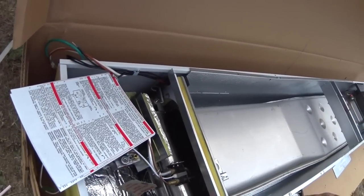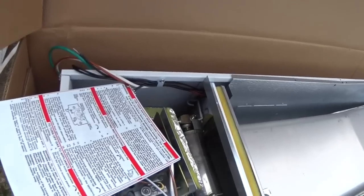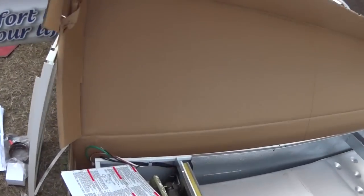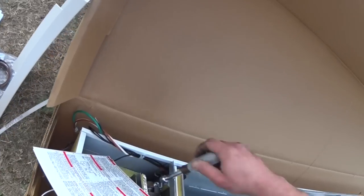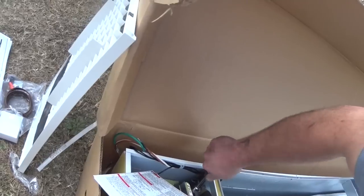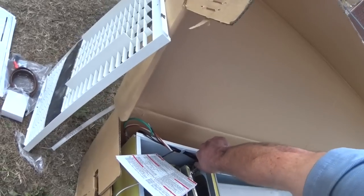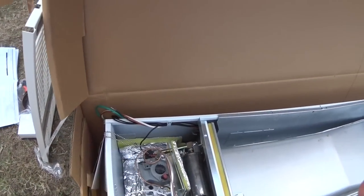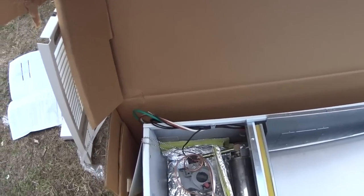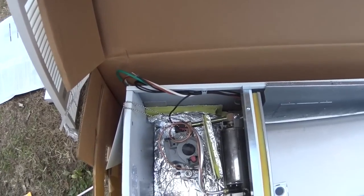What was that service call last night? I ran two. One was a unit blowing cold air. Of course, it's running fine when I get there. That was a gas pack. That one was dropping out randomly, and I'm suspecting that the pressure switch contacts aren't in good shape, because I only had like 15 volts going to the gas valve when the system first fired up,